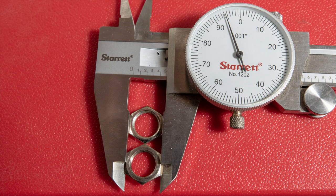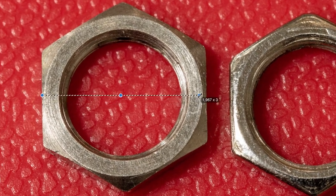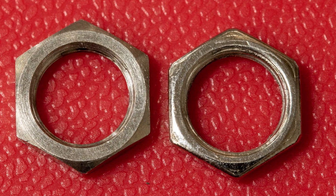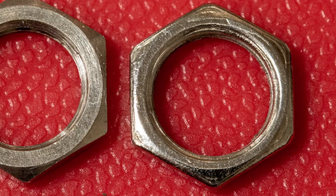Now what is half an inch is the nut that fastens on the outside of the guitar body. At its widest point, the nut is a half an inch, but if you look a little bit closer at the nut, you'll notice that the bearing surface of the nut is less than half an inch. You can see from here out to this point is half an inch, but where the bearing surface is, even on a good machine Switchcraft nut, it's actually several thousandths of an inch inside. On the cheaper import nuts, you can see how sloppy these are and how that bearing surface is well inside — well under a half an inch.